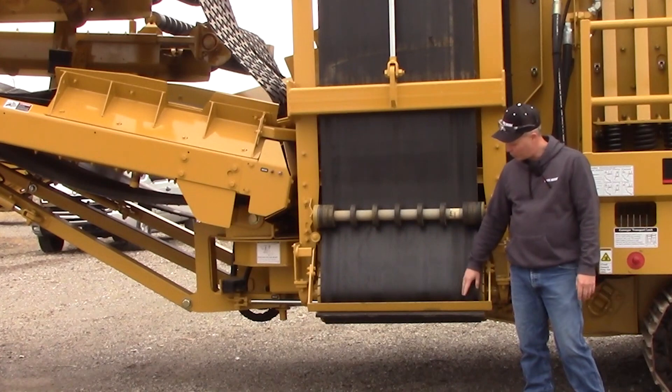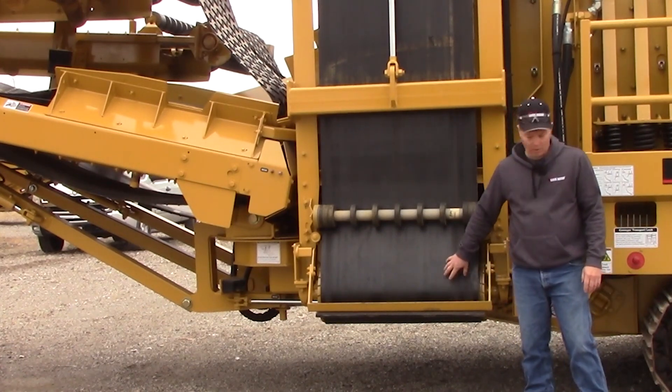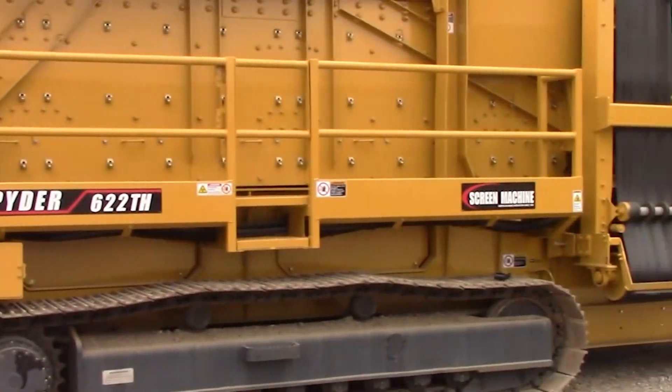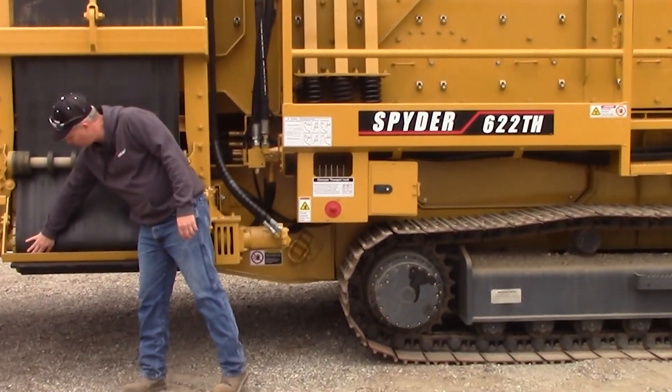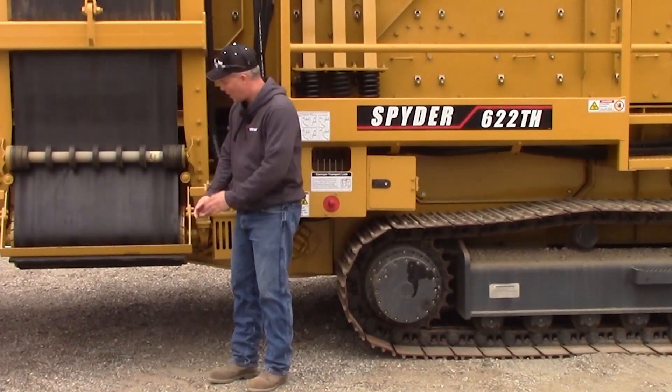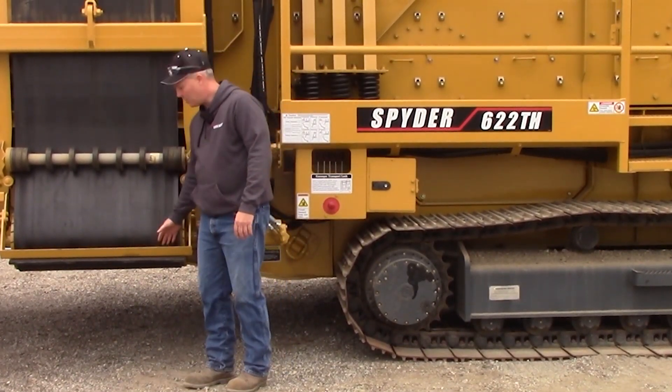You have one on all your smooth belts. There's one on your small mids and one on your fines. So what you want to make sure is you have good contact here — make sure your rubber or plastic has contact in the belt. You don't want to see any gaps in here.